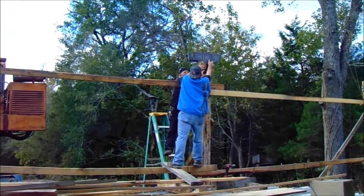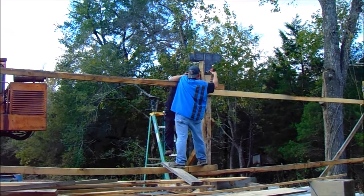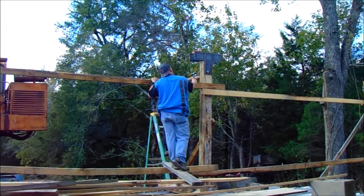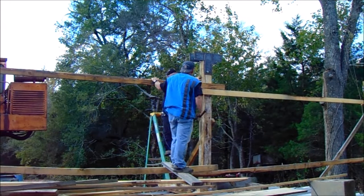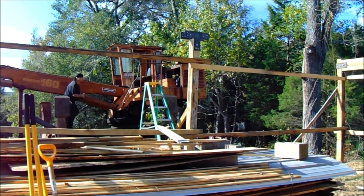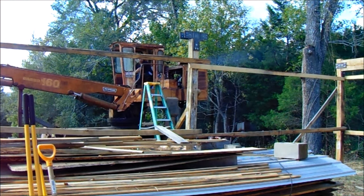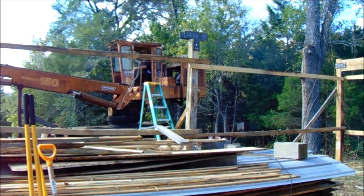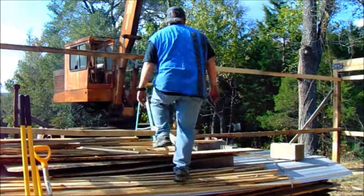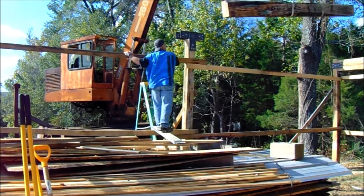And you can see here, we made a T-bracket out of that 3/16 plate. And them brackets are doubled. So I made one that goes across. I forgot exactly how long it was, like 18 inches or 20 inches, I don't know. And then I welded one underneath it, and then I plated over both of them. So it's doubled on both sides. So you ain't got to worry about it having a weak spot on the weld, because there's another plate over the weld. And the weld's pretty good too, but I always try to overdo it when we do it. Take a little bit longer and just do it.